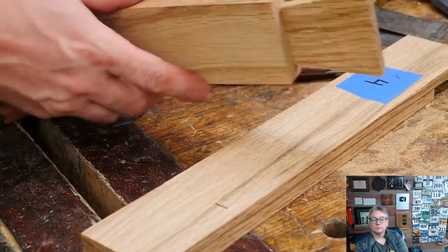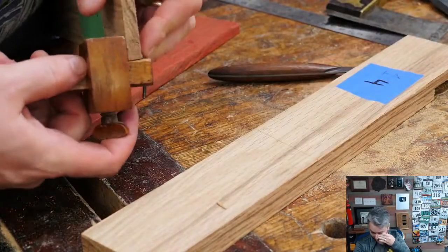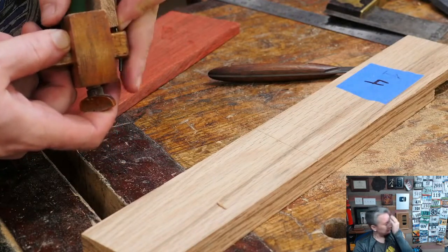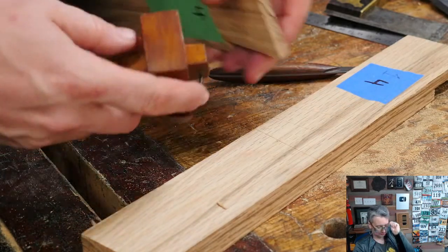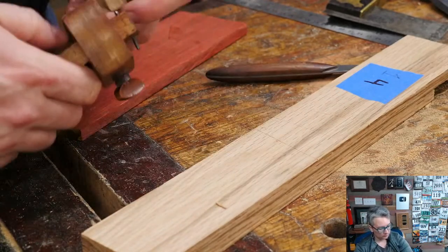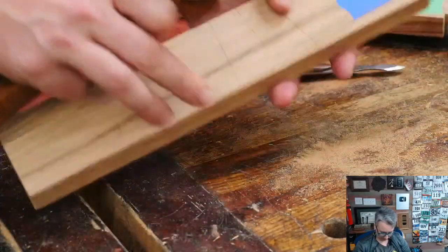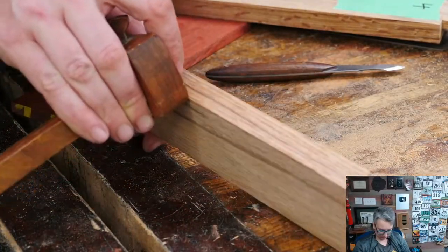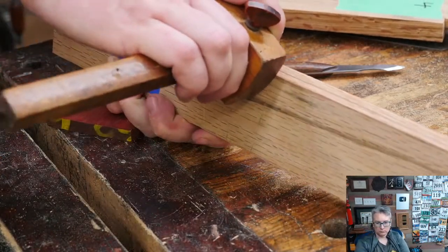And now I'm going to reset my marking gauge that I just messed up. And I'll set it to the thickness on here. Actually, just do a little less. See how that came out. Perfect. Okay, now this is my reference side because it's the side with tape. I'm going to come in here, I'm going to mark the depth that I just had on there. How deep down do we want this to go? Any questions we have while marking on this?